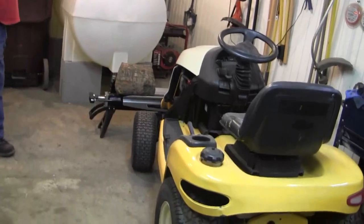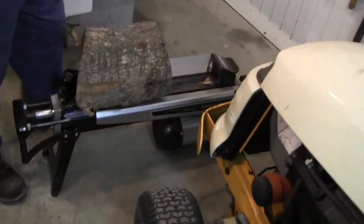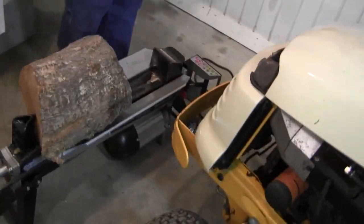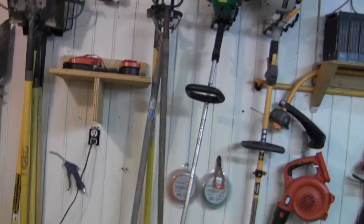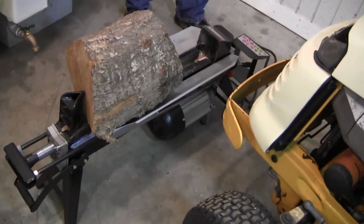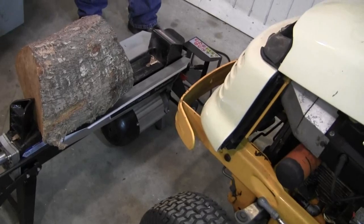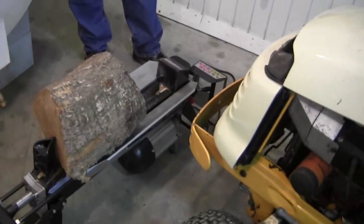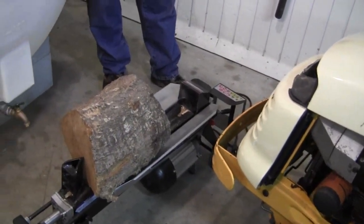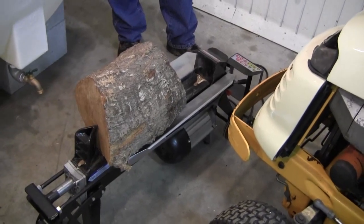I got to put a... You done broke it? No, I got to put a separate outlet in for that, because that's only a 10 amp outlet right there. And this needs 15, 20 would be better. It keeps kicking breakers off because that little motor pulls so many amps. It's not the outlet you need, it's the fuse. Well, I want to run a dedicated outlet right over from the box over to this.